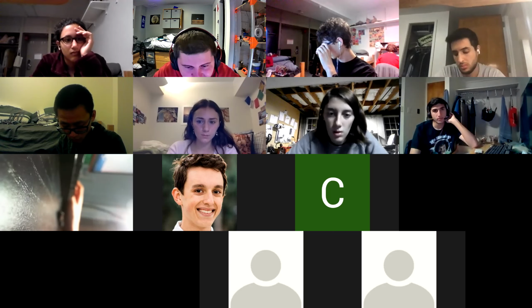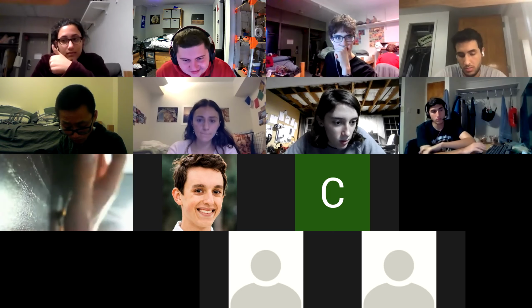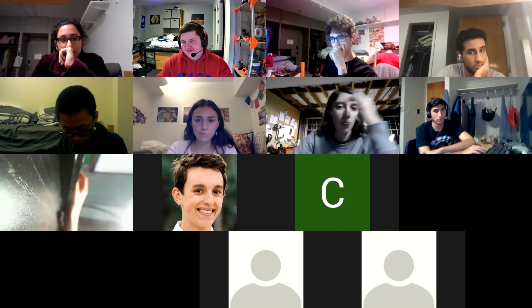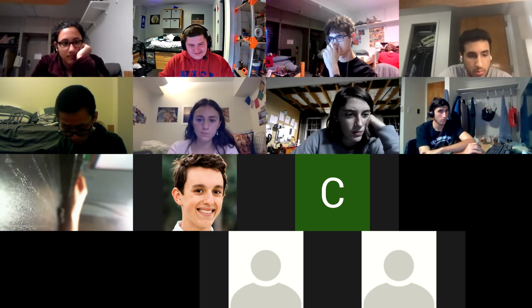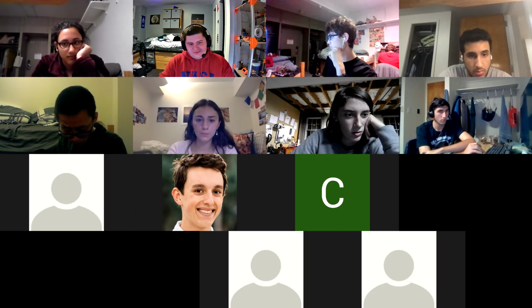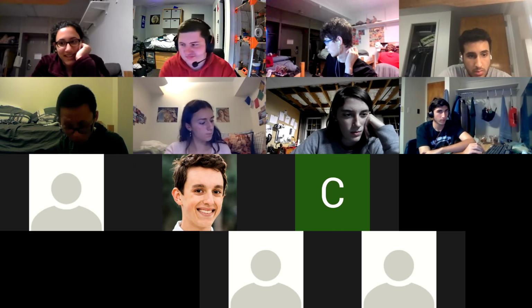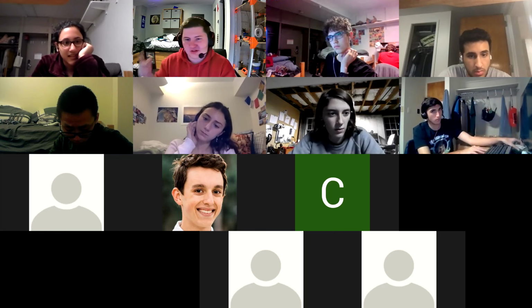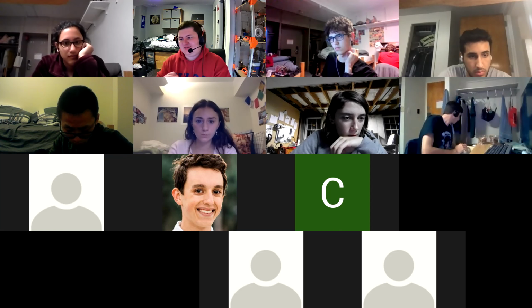I resent it. Yep, that's pretty much exactly what I was looking at. You don't actually even need to do the for loop for that, because you have the loop already. Yeah, I wasn't really sure how. Well, what you'd want is a delay between every time you write it, because it takes a few milliseconds for the write to actually propagate.